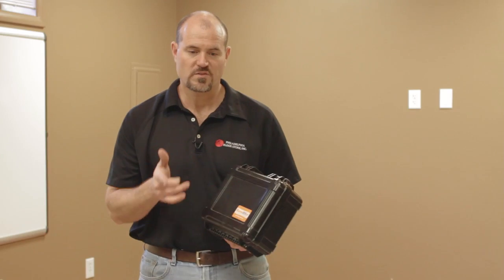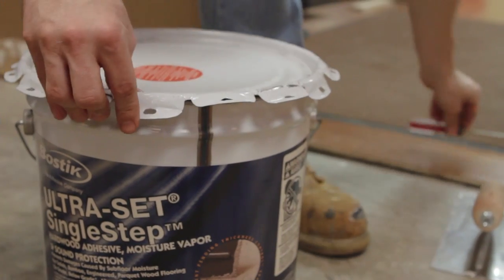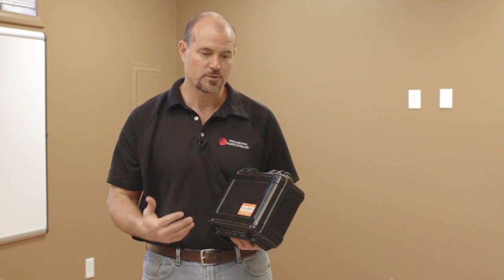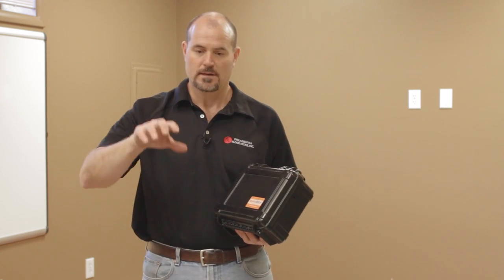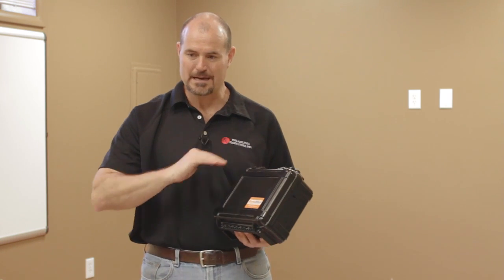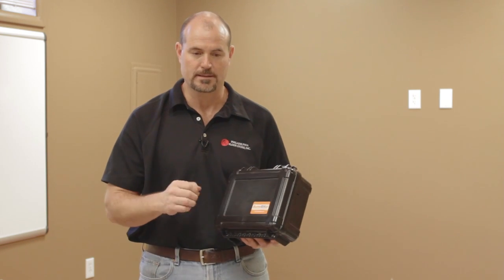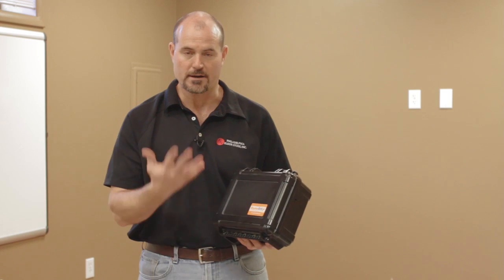We test the relative humidity of the slab to make sure that the adhesive we're going to use will keep the floor in contact with the cement slab. It gives you an understanding of what's happening inside the slab down a certain percentage in depth, so that when that slab is covered and normal airflow across the slab has stopped — you've now capped it — there's going to be a buildup underneath there of the moisture that used to migrate through.